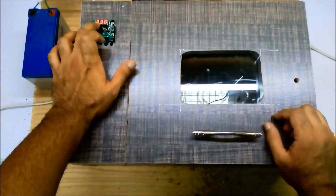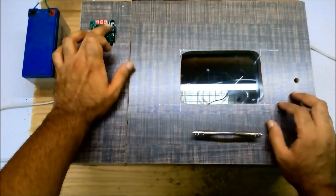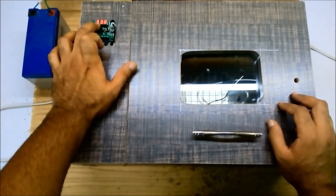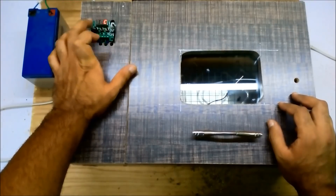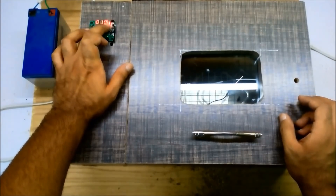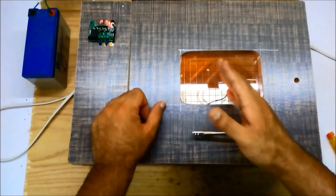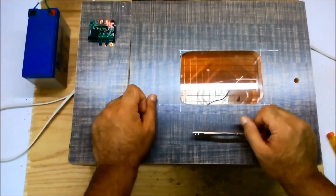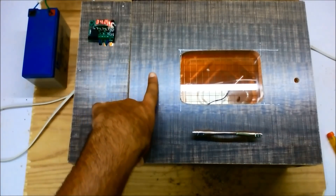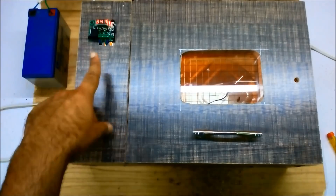Press the set button — one time it shows 50, but it should always be 38. Press the set button until you get P0. When you get P0, press set again — it shows cooling, but we don't want cooling, we want heating. Then go to P1. I'm going to set P0. The bulb is on — I have forced the bulb to be on. When it reaches 38 degrees it will turn off the heat source, and when it drops to 37 degrees it will turn the bulb back on. Let's see if it is working perfectly.